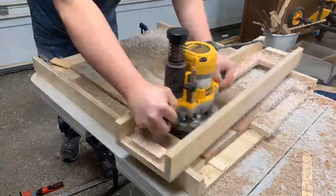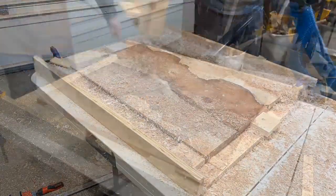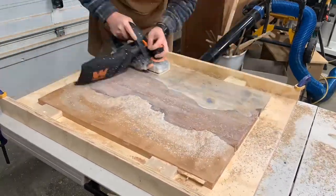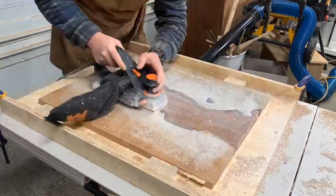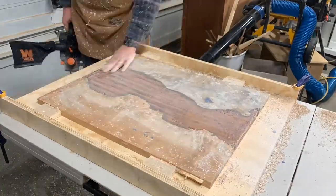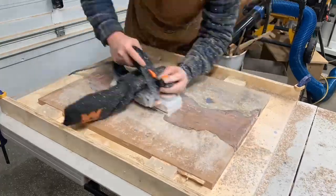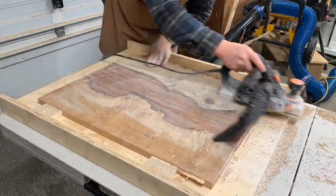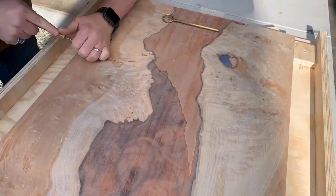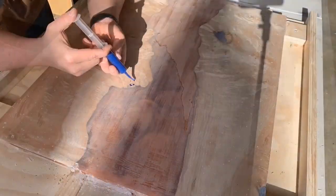Because I had so much chip out on the epoxy itself, I decided to clean that up. I pulled out the power planer just to kind of smooth it out after lots of router time — just to remove some of the marks and get a uniform thickness. As you go down layers you reveal stuff, especially if you've got wood with character or bug holes. So throughout the process I constantly had to refill little holes. Here I'm using an ice pick to clean out any sawdust left over from bugs and whatnot.